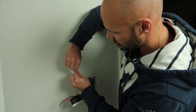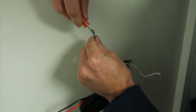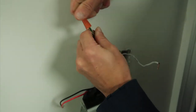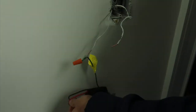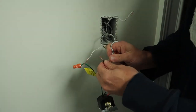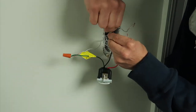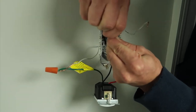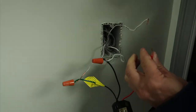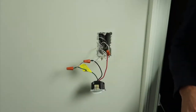For the ground wires first, you want to twist the wires together clockwise — the direction your caps are going to go on. Make sure they're twisted really good and check that they don't pull out. Then do the same for the other two wires. I'm using the wire nuts that came with the light — they give you three, one for each connection.